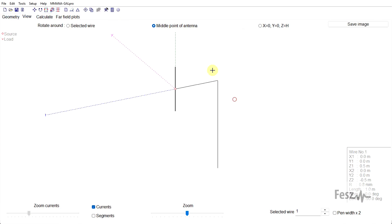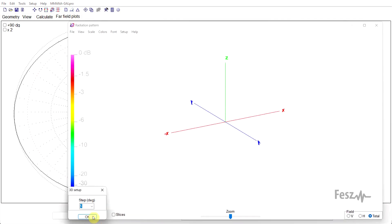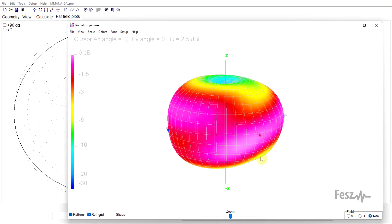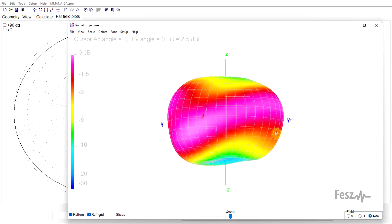Finally, if we add in a mast — a line parallel to our initial dipole, something needed to mount our dipole in a vertical position — and we re-simulate, the numbers are starting to change. We are getting a slightly different impedance, slightly different gain value, and if we check our radiation pattern, this starts to be different — it's not a uniform donut anymore. So while you do need the mast to physically support the antenna, you can't really prevent the metallic support structure from interacting with the antenna fields. This is the fundamental problem of such a structure.